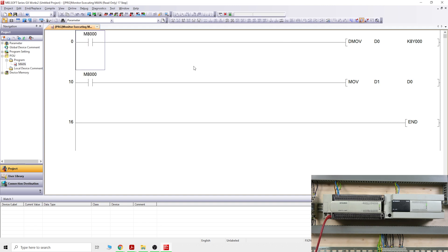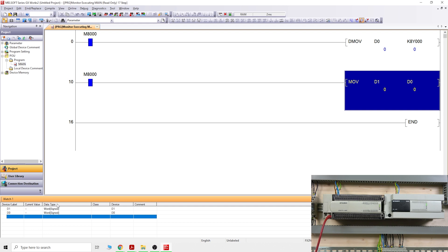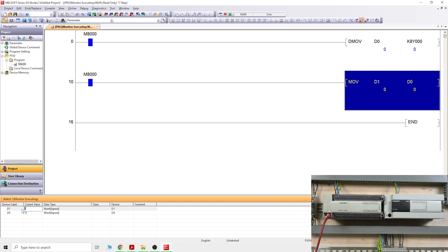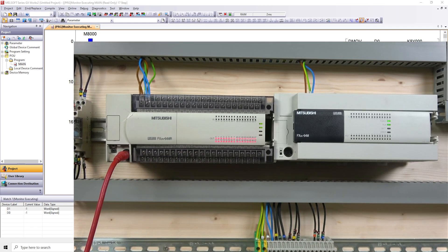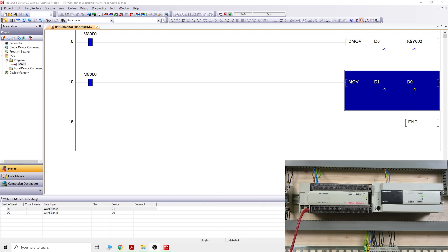I'm so not used to this — I've been using FX3 series and FX5 PLCs, so this slowness is unusual for me. We're going to go into Watch mode. We're going to change the value to minus one, and as you can see all outputs on the PLC have come on. This method is a great way to bench test a Mitsubishi PLC. You can see all outputs are on, and you can do a resistance test across the board to verify all outputs are good — I do that all the time because I sell these PLCs.